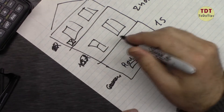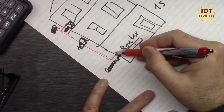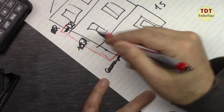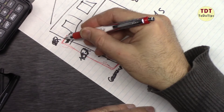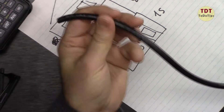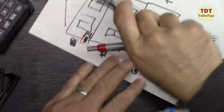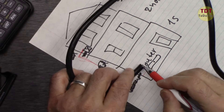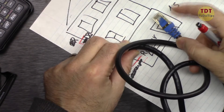We have to drill the wall at this point and also drill the wall at this point. I'm going to put a cable from the first floor, outside the home, and pass it up. I'll start from the second floor, drill through, and in order for the cable to pass — because my drill creates a small hole — I've cut the connector tip so this piece will pass first. Then we pass the cable, hang it, pass it to the first floor, attach it back, and plug it into the main router.